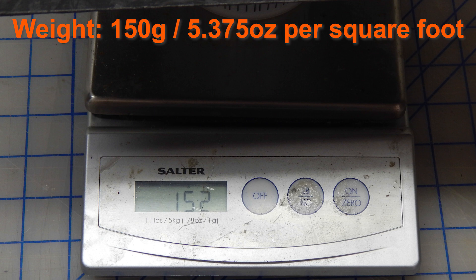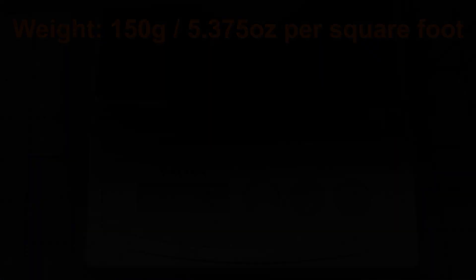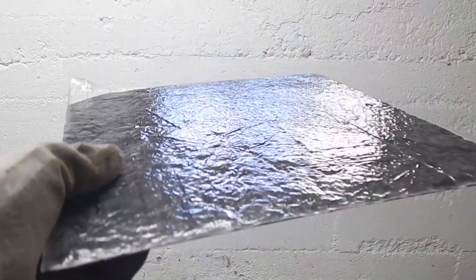Shiny. You can see I didn't get it uniformly enough — there are some places you can see air through. I trimmed it up and weighed it: about 150 grams, or 5.375 ounces per square foot. It actually looked kind of neat — sort of random, with fiber pointing in every which way. On the peel ply side you can see how uneven it is and the clear spots where there just isn't fiber in some places. If I had laid them out dry and infused it, or used additional plies and wet laid, that would have made it much more uniform.